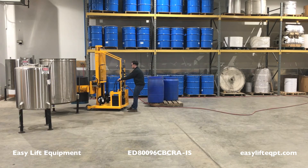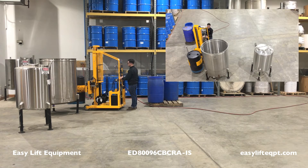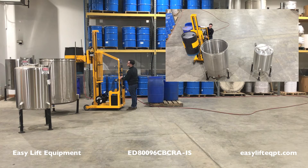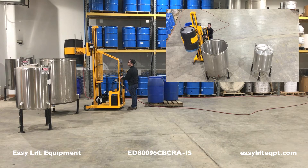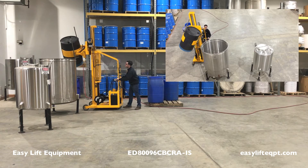Apply a small amount of forward motion to push the unit towards the drum as the jaws are closing. This will ensure that the drum is gripped tightly. Lift by pushing the lift lever to the upper position located on the valve control box. Be sure to look for any overhead obstructions that may contact the elevated drum.